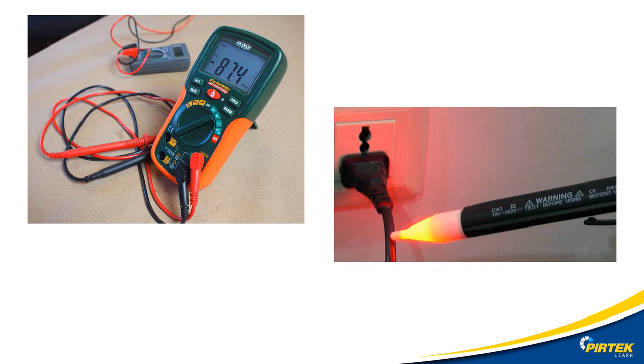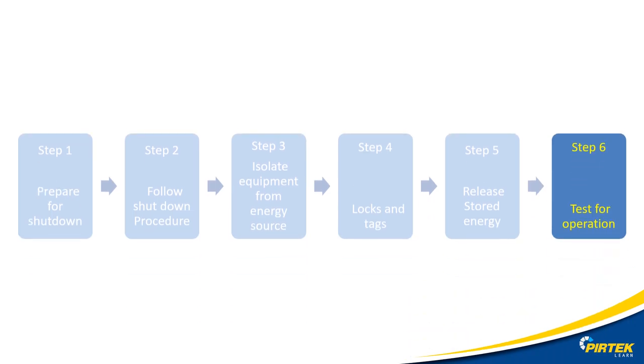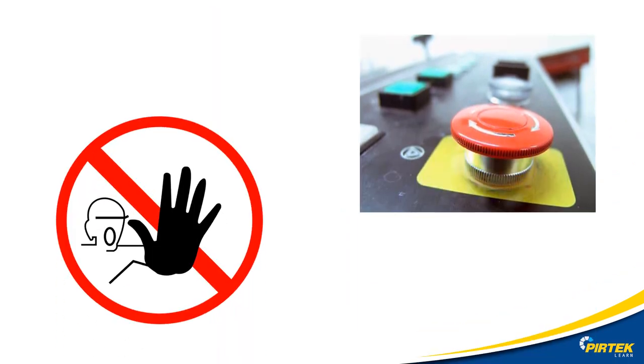Be aware — the equipment may be incorrectly wired or labelled. A quick test with a multimeter or a voltage detector is a good way to confirm that the electrical supply is isolated. Personally, always double-check with two meters: a multimeter and a voltage detector. A clamp meter can also be used for double checking if you don't have a voltage detector. If you're not familiar with using these devices, get a qualified person to assist you. The last step in isolation is to make sure that the machine doesn't turn on or operate. Make sure the machine and the area is clear before testing.